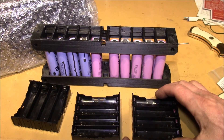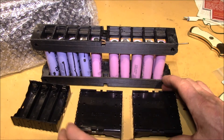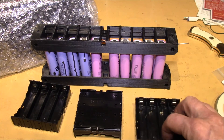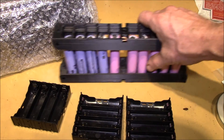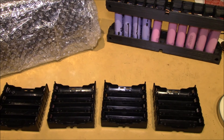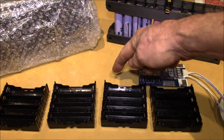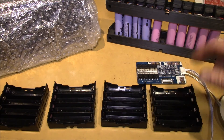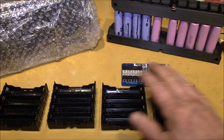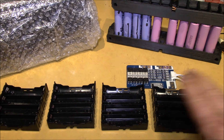I want to run the tabbing down the middle, have the jumper wires, do all the soldering upside down, and then flip the whole assembly over and screw it down onto a sheet of plywood. I'll have four packs with a little gap between them. I'll leave room so if I want to add a BMS board I can leave some space at the top, with a balance connector I can hook up to either the BMS board or a LiPo battery charger. I'll probably build two of these — one with a BMS and one without — and put both in the system to run them side by side with the same charging and discharging.